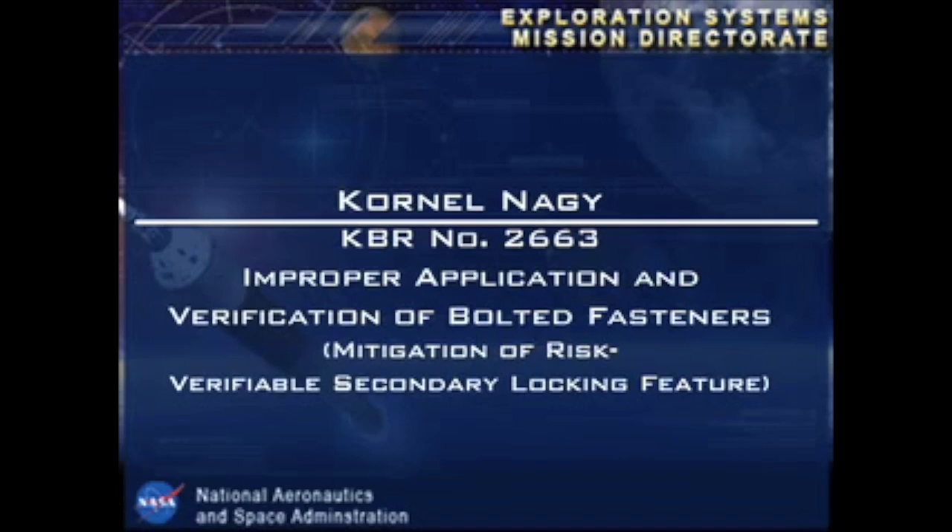So we have had a conscious effort in our fasteners to have locking devices which are verifiable. The other issue with secondary locking features is that most of them, as you apply them repeated times and take apart the joint, reduce the effectivity of that locking device. That's why we have specified minimum running torques for different locking devices that have to be achieved to assure they are still properly functioning. This is stated simply, but it's a very meticulous effort.